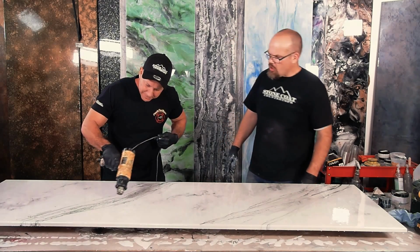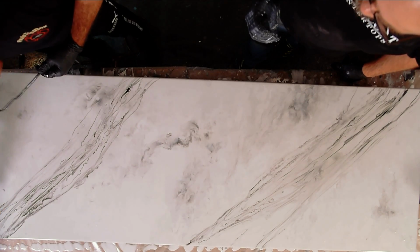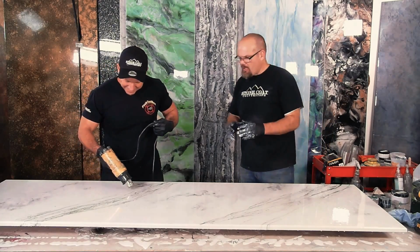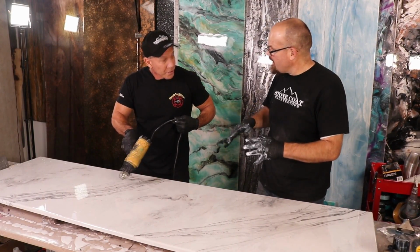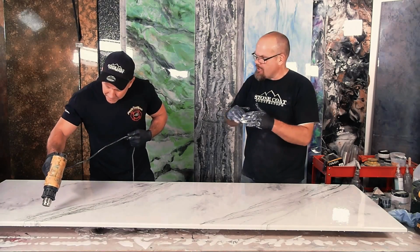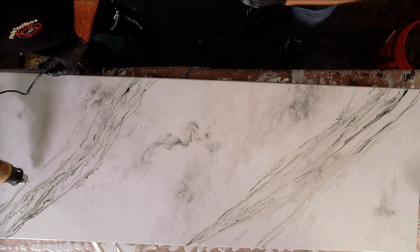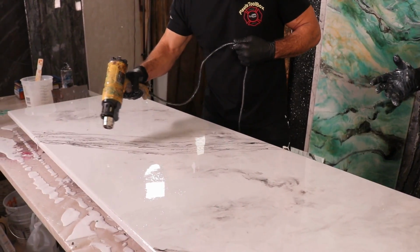We started with concrete countertops, and we realized quickly that the real neat color effects were in that top coat of epoxy. And then we wanted to get an epoxy that could flex with wood and overhangs on Formica and natural wood when you're coating it. If you went with too hard of a formulation, it would fracture at those flex points and fulcrums, right? So that's where the whole formulation started and began. Then we wanted it heat resistant to pots. We wanted the most durable product that was the most user friendly we could come up with.